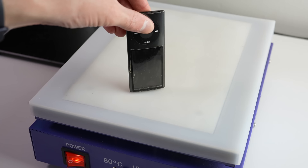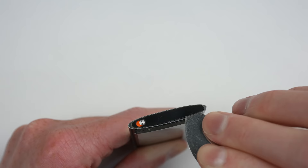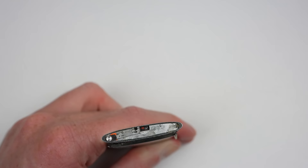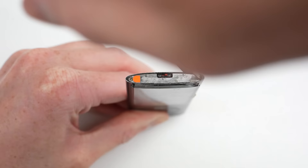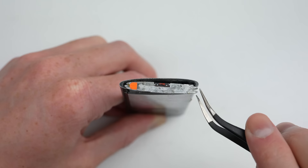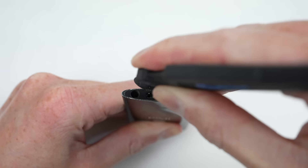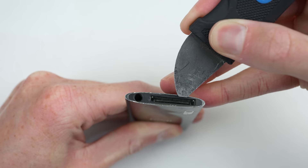It's time to open up this iPod. To do that, I'll begin by heating up the top of the iPod on my heat plate. To fully access the internals, they'll need to be slid out of the body of the device, and that's easier said than done. Starting with my iFixit Jimmy tool, I can wedge my way under the plastic top section and remove it, revealing the mechanism for the hold switch and two screws. After the hold switch bracket is out of the way, I can unfasten the two screws holding the top bracket in place. Attached is the hold switch by a fragile wire that's a millimetre wide.